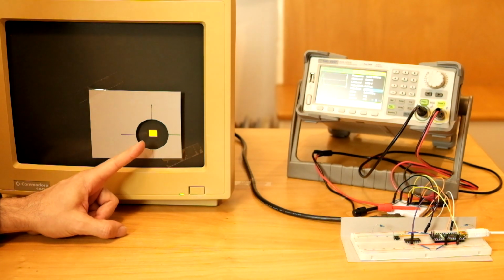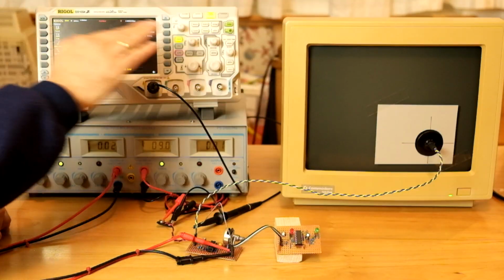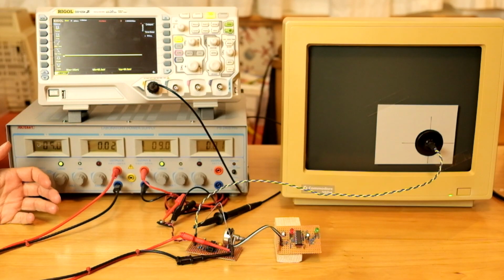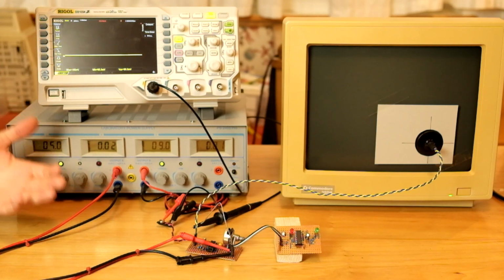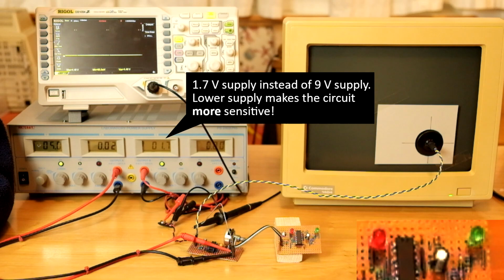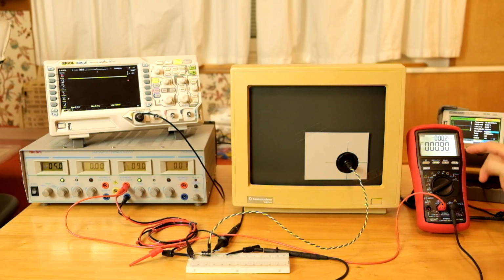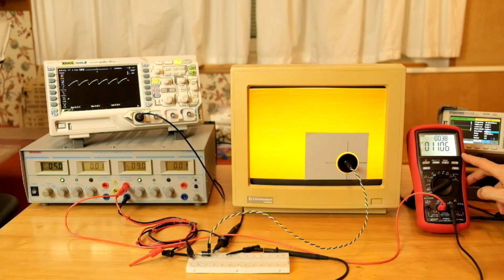Literally. When I tested the circuit with the 1404, I got a total flatline at the output. It did not work at all. Well, I found a workaround that brought it to life. After taking some measurements of the phototransistor current, I was a bit wiser and I had learned quite a bit about both the 1404 and our receiver circuit.